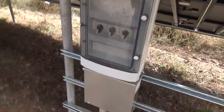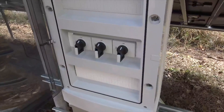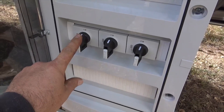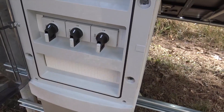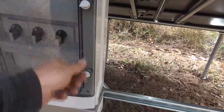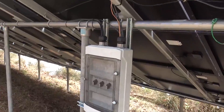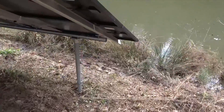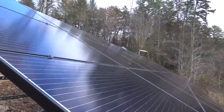Just want to show you this cool disconnect that Johnny found. It's from IMO — an IMO disconnect. We've used these types of switches before; these are a little bit different. Hot water and air conditioning are on this four-pole switch, and then we have solar — two strings of six and two strings of seven — on this disconnect. It's a really cool, reasonably priced, outdoor-rated disconnect. We're done with the array at 10.8kW solar, 36 Trina 300s black-on-black triple-blacks.